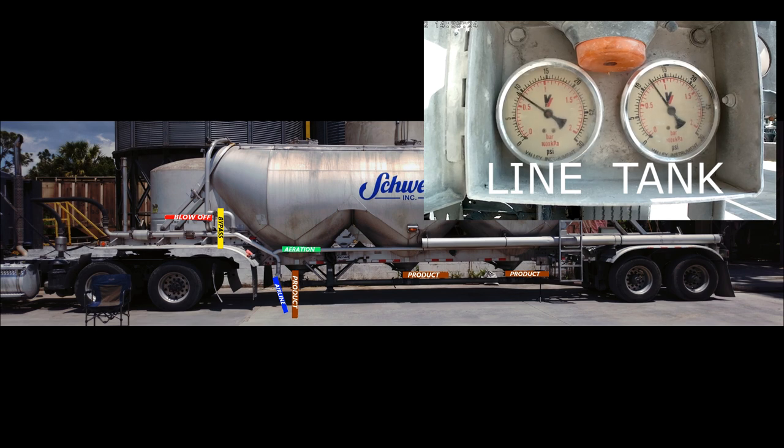Another company I used to work for, the blower was set at 1200 RPMs on truck side, and I'm not sure what PTO ratio was, but it pumped out a lot of air. We needed it for the type of product, which was called pebble lime. The size of the pebble was about the diameter of a dime to a quarter in size. Took a lot of power to push it.